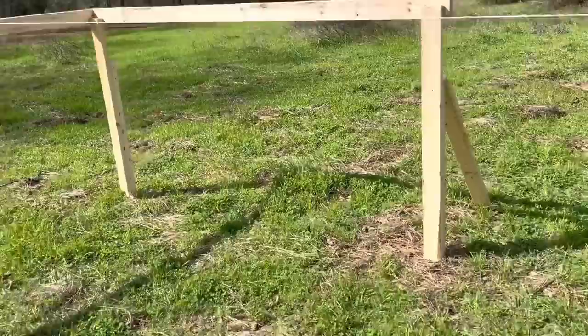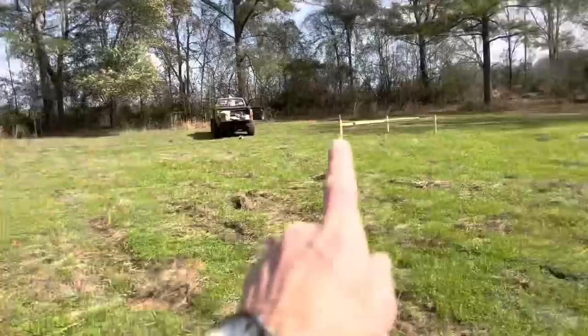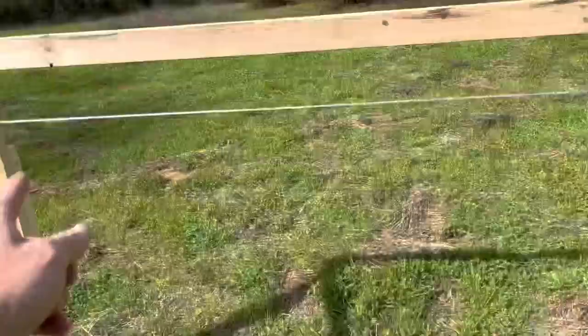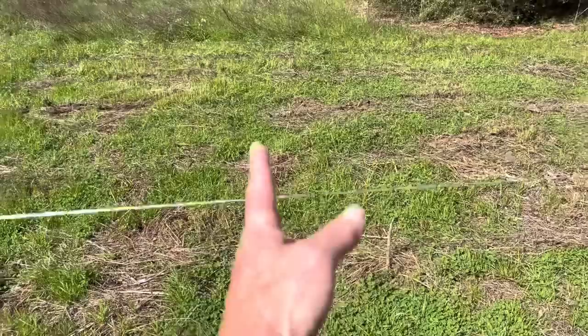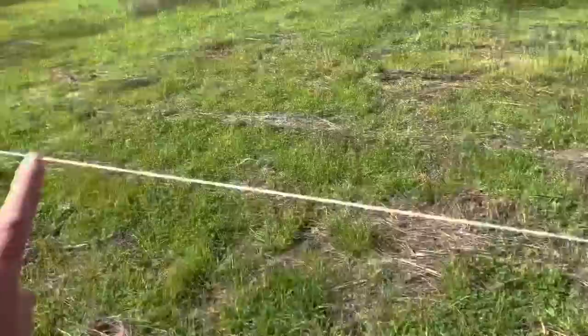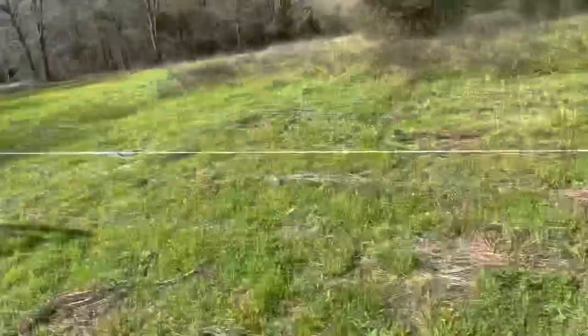It doesn't matter what measurement you take, just make sure you take the same measurement on both sides. I think I went with 68 foot — just a guess. 68 foot comes to right there. I put it on that screw and pulled 68 foot and made a mark. Now what I'll do is pull from that mark to this mark, get the measurement, half that measurement — divide it by two — make a mark in the middle. Wherever it comes to, I'm going to pull 24 that way and make a mark and 24 that way and make a mark, and it will be perfect. I've done it so many times and it comes within a sixteenth or an eighth of an inch of being dead perfect every time. And then you'll have a mark there at your 48 foot on both sides, and then you can run those strings across.